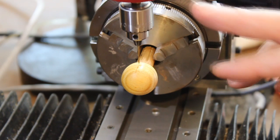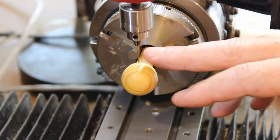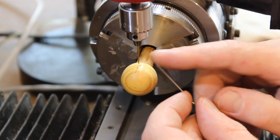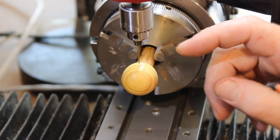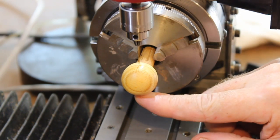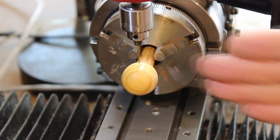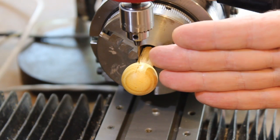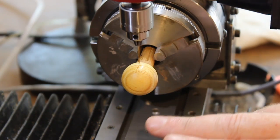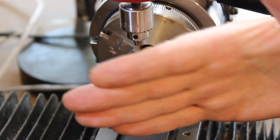What I'm set up to do right now is drill some tiny holes. This is a number 68 drill bit. I'm going to use this very, very thin piano wire to put a pin here, and then 180 degrees below it, down here. That will hold the rings at the equator. I'm then going to tilt everything and drill another hole so that I can run the rings on an angle like this.